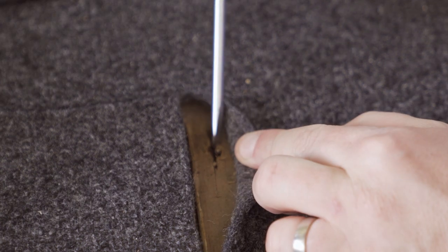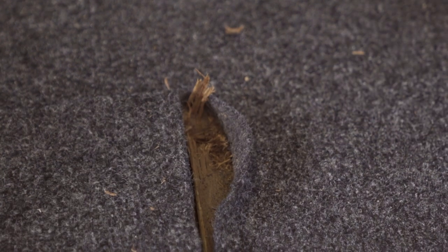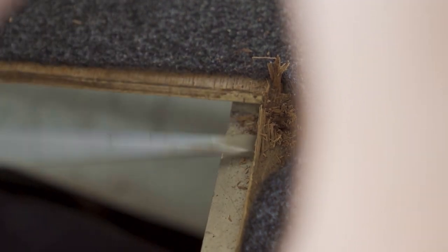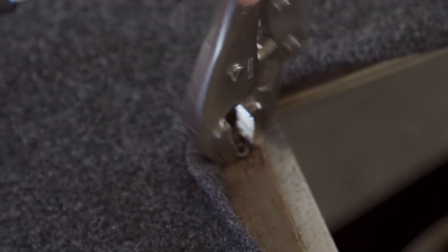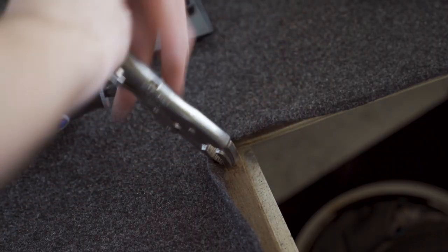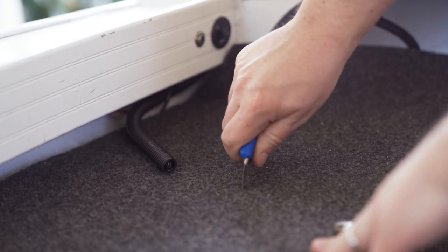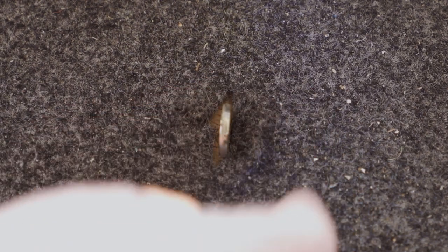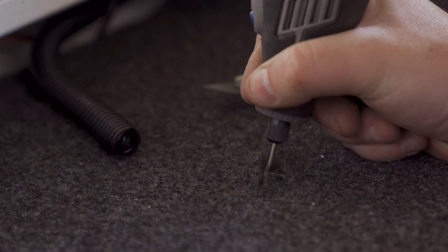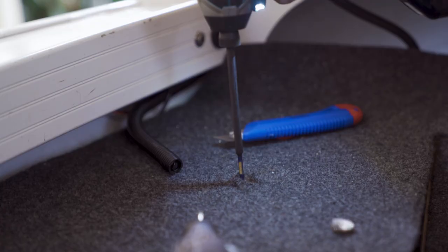This is a pain as a second owner — if I wanted to do some maintenance underneath the deck or get easier access, it'd be nearly impossible. In the end the deck was persuaded to extricate itself from the screws, whilst other screws required coaxing with vice grips. To find the less obvious screws hidden underneath the carpet I used a magnet to sweep across the surface, allowing it to snap into place above a screw. Then cutting the carpet revealed them so they could be removed. I found using a Dremel to clean the gunk out of the Phillips head made it feasible to unscrew the rusty corpses.